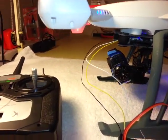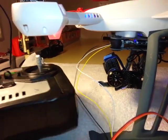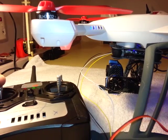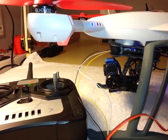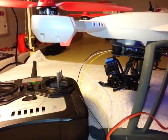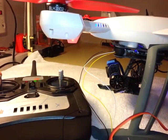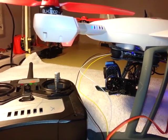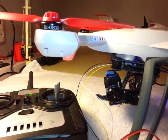So what I've been able to accomplish, again with the lead for the camera pitch connected to the throttle channel, you can see that I now have independent control of the pitch of the camera, which is absolutely perfect. Now, it might seem like a bit of a pain to have the second radio, but for my purposes it's fine, because all I'm concerned with is having it tilted down for high altitude and maybe just moving it up a little bit for low altitude passes, and again it gives me the ability to angle the camera so that I can get those front arms out of the way.